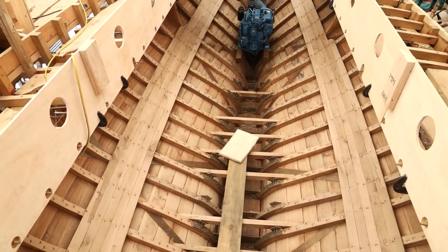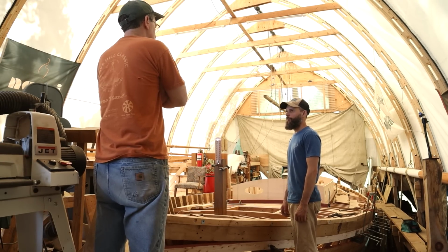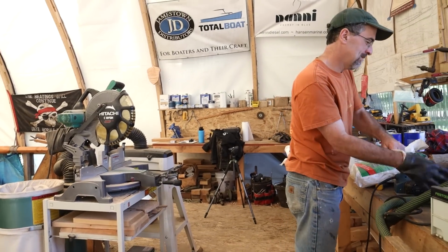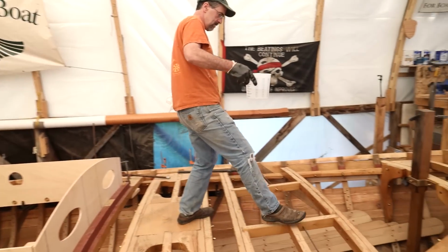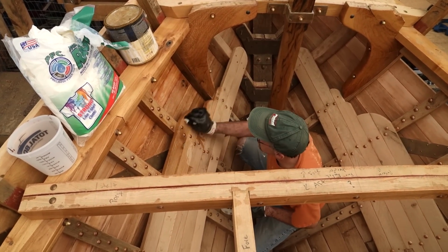And wipe when the rag gets gross. We'll toss it. When the denatured alcohol gets gross, toss it. But it'll pick up a ton of the sanding residue. Okay. And it'll cut a lot of the oils, and that'll let the teak sealers go right in. Okay. Awesome. And you don't have to be super crazy meticulous. It evaporates so quickly, you can really just slosh it on there, get it wet, move on. Cool.